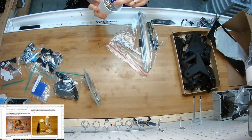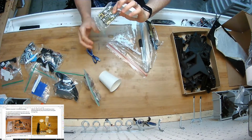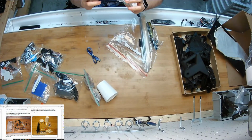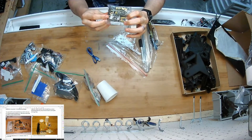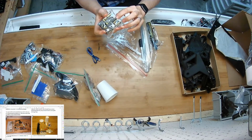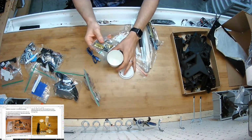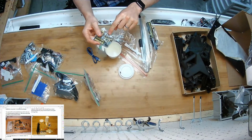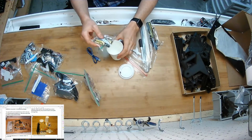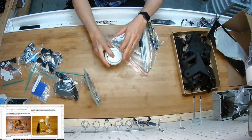And with the Arduino Nano inside, it's fully, that's important, I'm going to point that out right now. The Nano, we ship them assembled and tuned. We have to adjust the potentiometer on those to match the current level that the steppers are expecting to be driven at. And if you don't do that, bad things happen. If you adjust these not carefully, you can let out the blue smoke. I've done that enough times to know that I should do it for you.